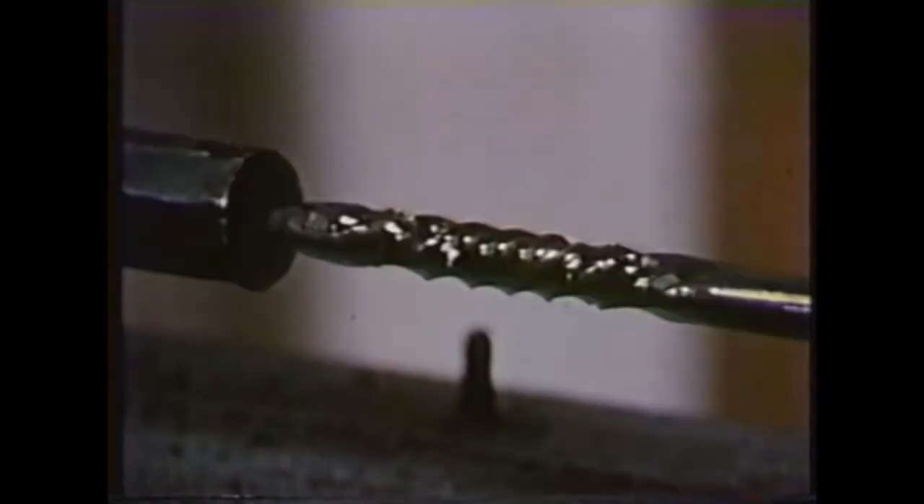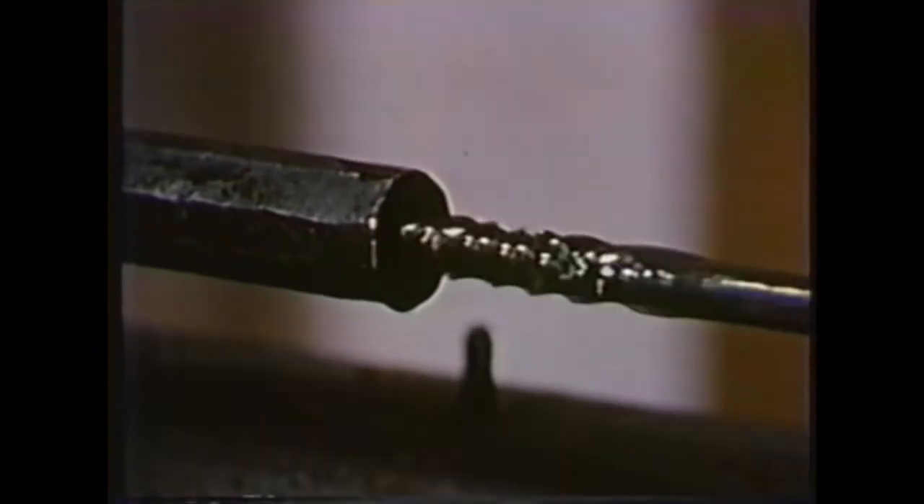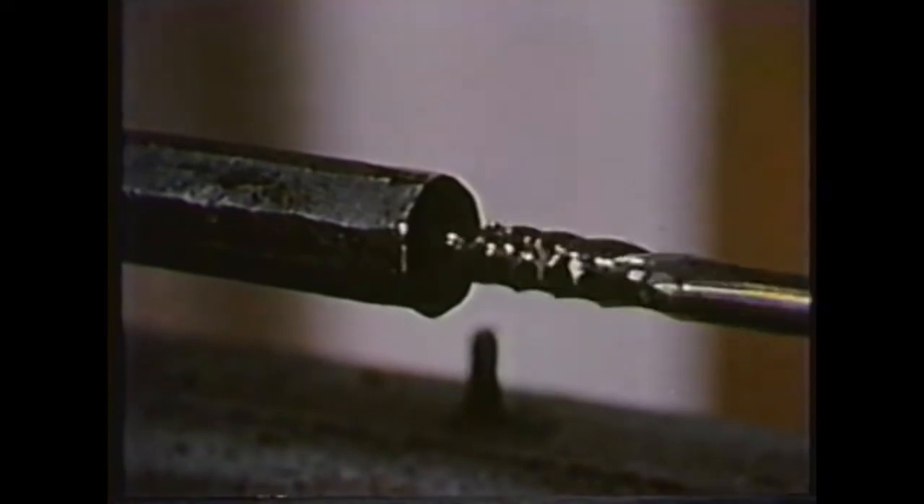The barrel may be taken out of the machine three or four times to straighten and inspect for flaws. Flaws are cracks or pits inside the barrel. The bits get larger in diameter and have a longer cutting surface. This helps bore out the crooks in the barrel — the longer bit will bore out a small crook that the shorter bit would have followed around.